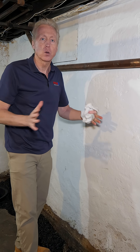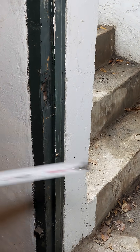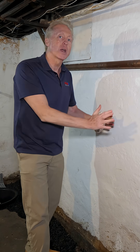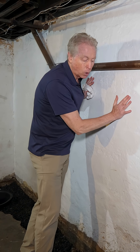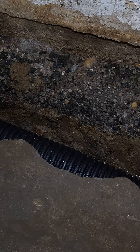Now, the walls are extra thick. A normal wall is 8 inches. These are right around 11, a little over 11 inches wide. You don't want your drainage right up flush against the wall. We allow the soil to stay intact. We move our trench in several inches.